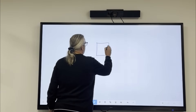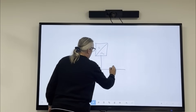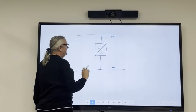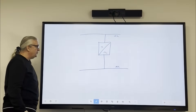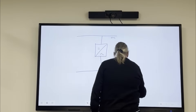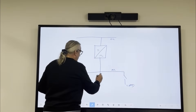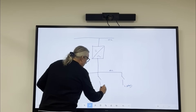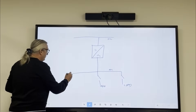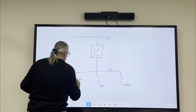So let me draw the inverter. This is an inverter here. We've got the AC side and the DC side. From the AC side, we connect to an AC bus. On the DC side, we connect to the DC bus, and the inverter is in the middle — so it's a single bus. On the AC bus, we've got our essential load, which goes through a relay. We've also got an auxiliary that connects to it, in parallel. And we've got the grid, which also has a relay.